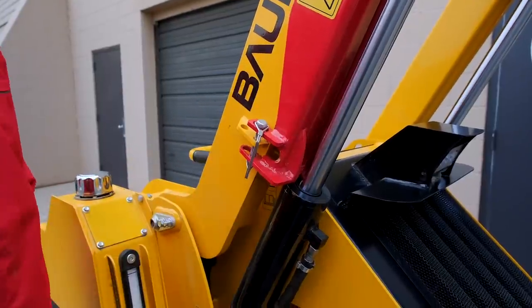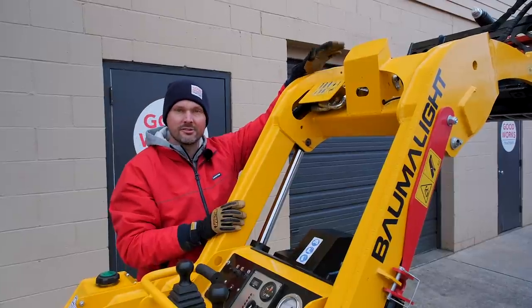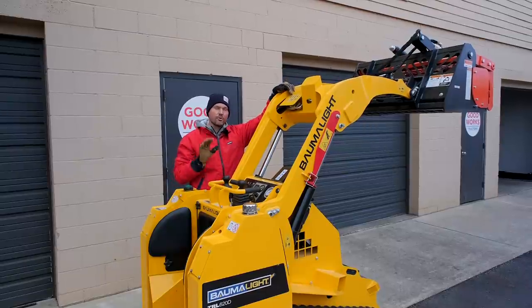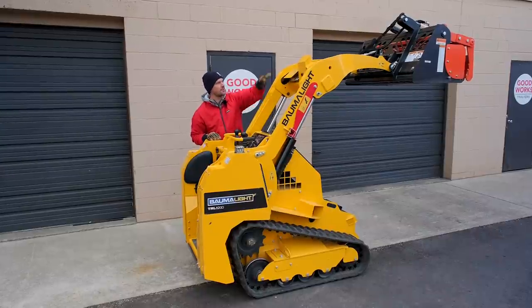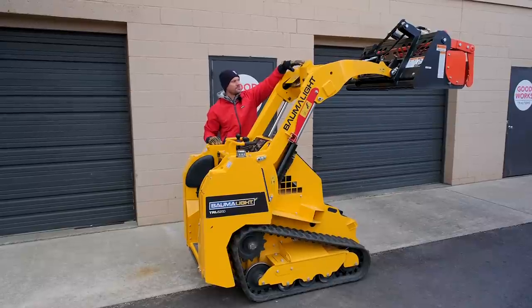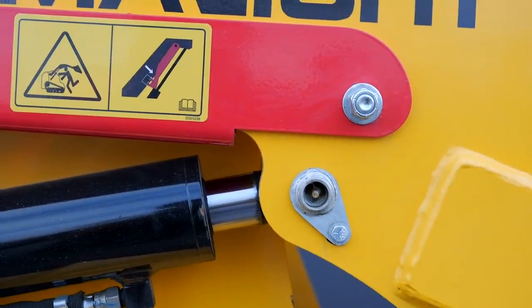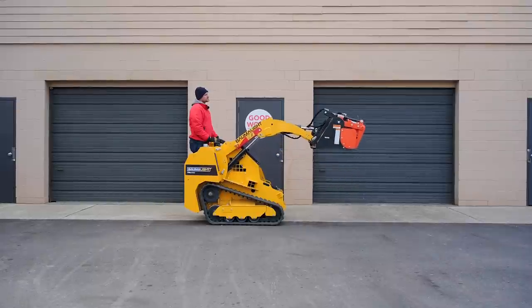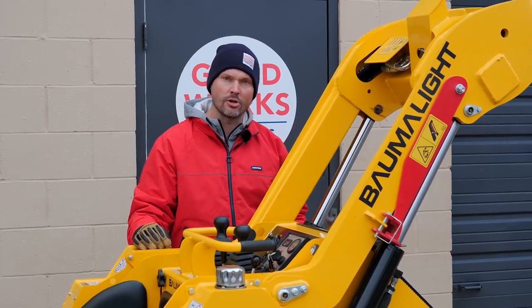My John Deere 324E didn't even have a case drain for the auxiliary hydraulics, so I was happy to see that a case drain is standard equipment on this model. There's an additional light on the boom as well - I'd love to see this on tractors, a lot more visibility at night. You have standard Zerks all along here for easy maintenance. This is a self-leveling loader, so when you're raising up it keeps your load level - that's pretty awesome. And your raise and lower cylinders are cushioned on both raising all the way up and lowering all the way down.